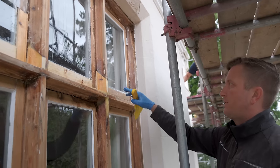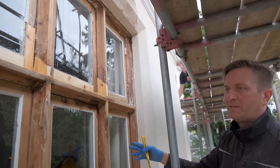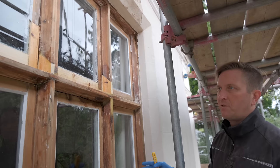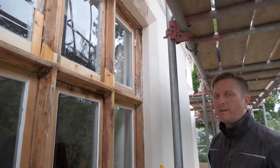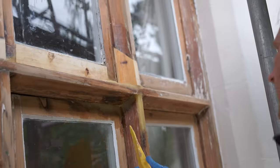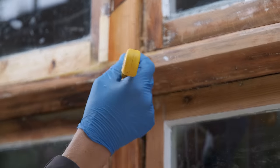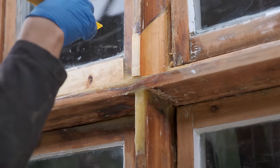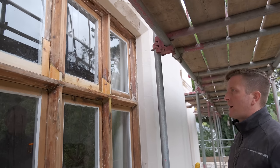I know when it's finished that this won't line up with that one — I know it probably hasn't for the past hundred years. And that's what we're trying to do — we're not trying to put it back perfect, we're trying to put it back so it doesn't look like it's been touched. If you do it too perfect, it just doesn't look right for this building. That's pretty good — it's lined in pretty well. When that's sanded it'll come up pretty smart. It's never going to look like this one until it's finished. This one was slightly easier because I've replaced the sill, which gives you straight edges to work off.